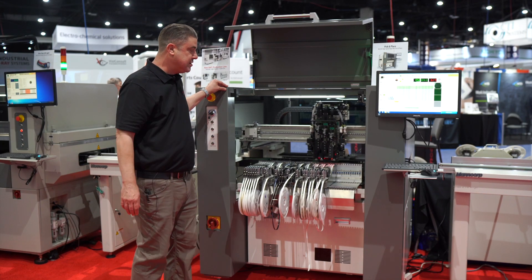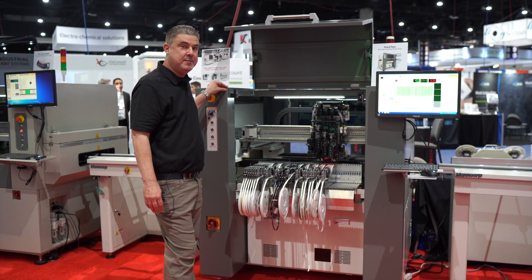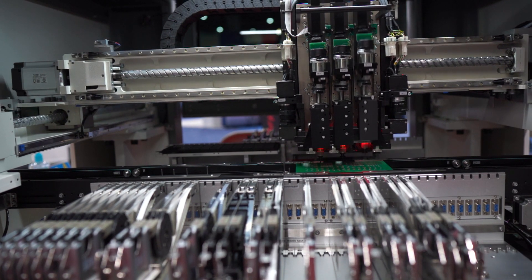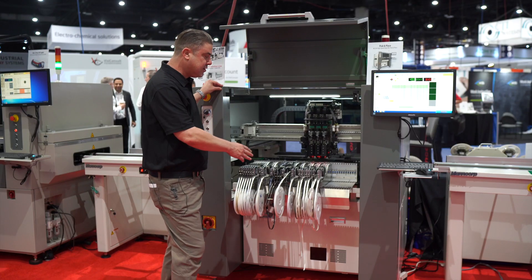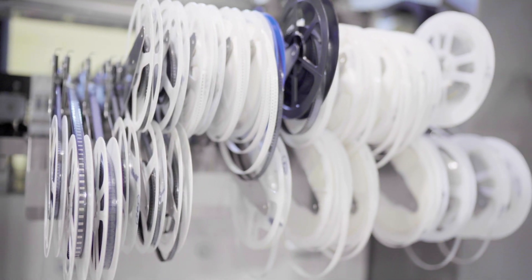The upward vision camera is capable of handling components as large as 100 by 150 millimeters with lead spacing down to 12 mil. The flying vision cameras are also capable of handling very small components as well as ultra fine pitch ICs. The feeder capacity on this machine is 96 intelligent feeders — 48 front and 48 rear.